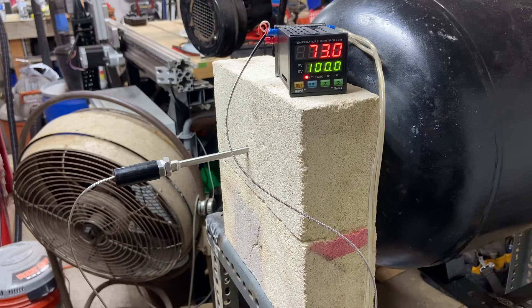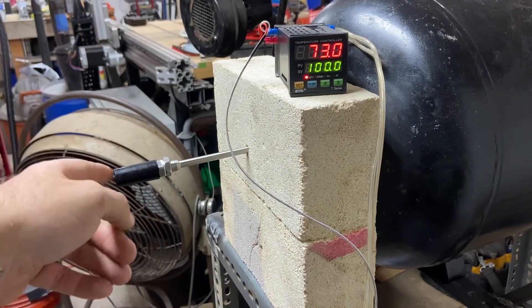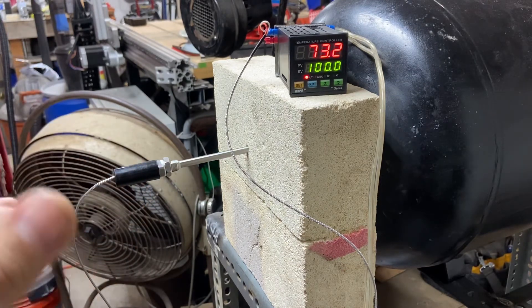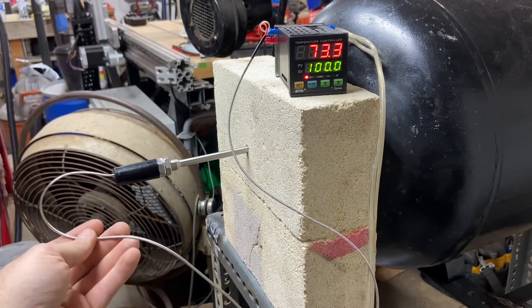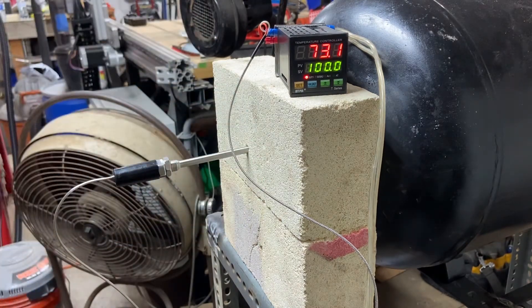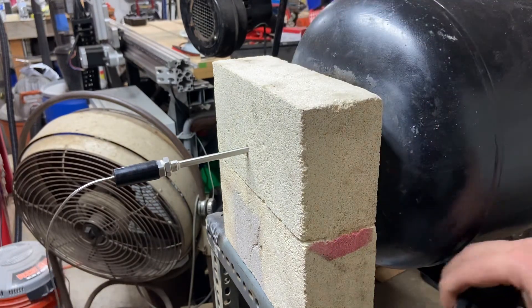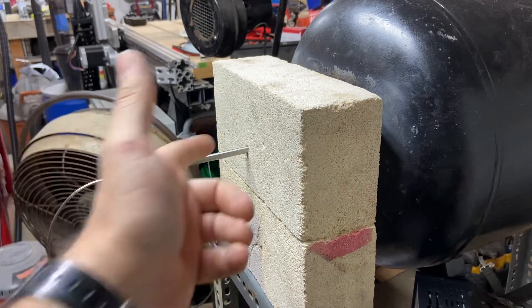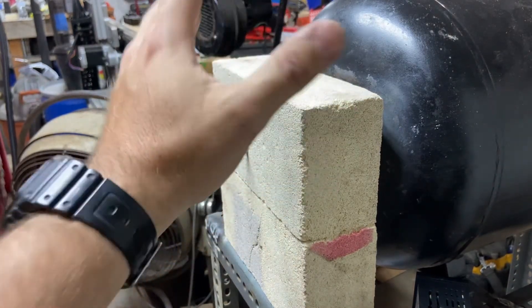Do keep in mind there are still a couple of little plastic parts on the back end, so make sure it is far enough away from any of the main heat sources that it's not going to melt. You do have stainless braiding on the wire and stainless on the probe, and that should be fine. For mine, I'm just sticking it through a snug hole that I drilled into a soft fire brick at the back center of my forge.